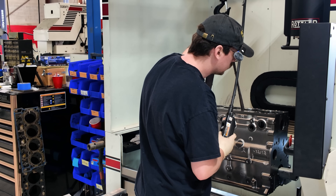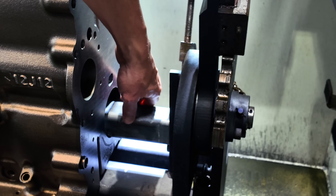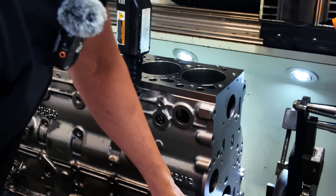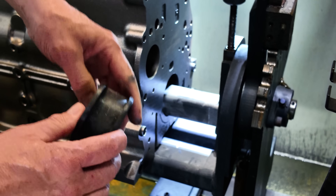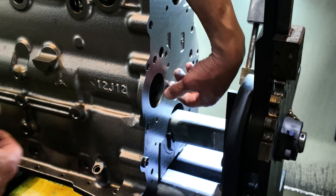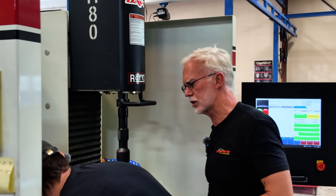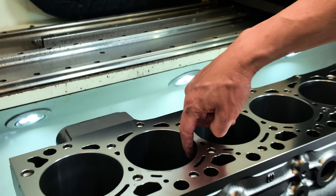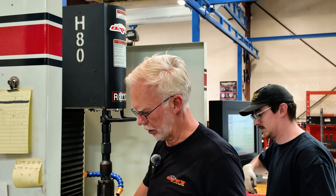Let me show you what kind of great guys I've got here. This machine — 100,000-plus machine, probably 150 grand with tooling — and we've got a problem. This bar locks in the block and holds it down while we're honing, but Jesse, my head machinist, realizes this bar doesn't really come down far enough — it's all the way down and not touching the main. So he 3D printed this little block that he can put in there now. It doesn't nick the main with metal — genius. So he's decked the block, bored the block, and that cylinder two that was scored really bad — had a nick in it — it actually cleaned up so we don't need to sleeve it. He's already chamfered the block, now he's just going to hone it.